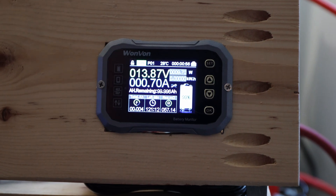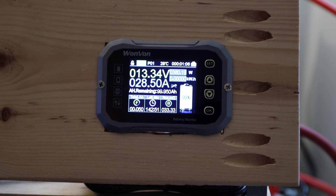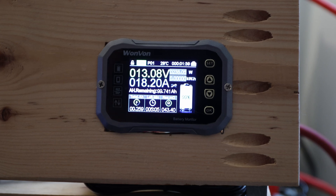As you saw, I charged it just a couple of minutes before, all the way up, so we're good to go — fully charged battery. Here we have the load starting. We are at 28, 29 amps, which — let's see how far we can get with this one. That's closer to the 0.2C. It might increase over time a little bit. I'll adjust the current amperage going out of the battery and I'll be back as soon as we're done with the capacity test to see how much we're actually able to pull out of this battery.